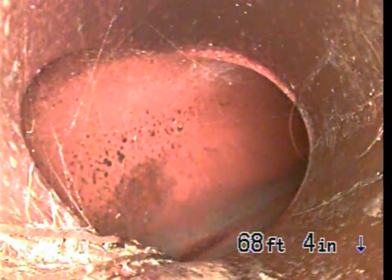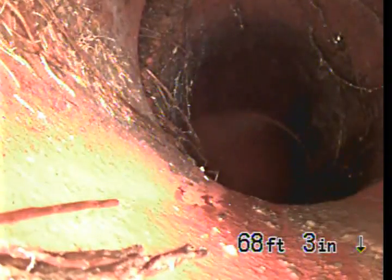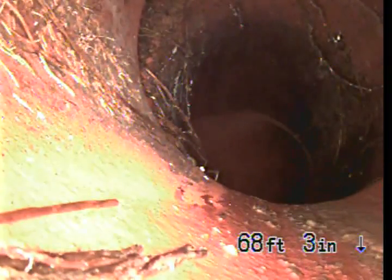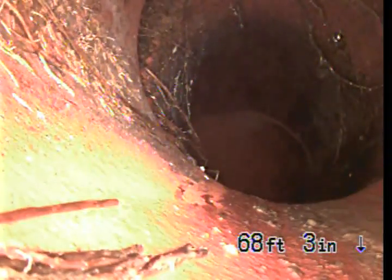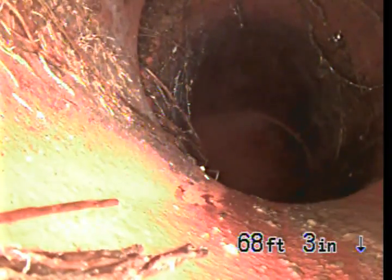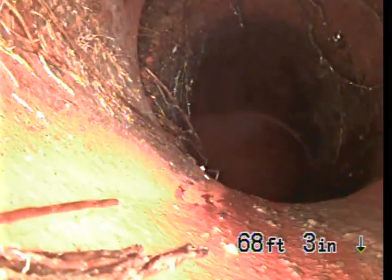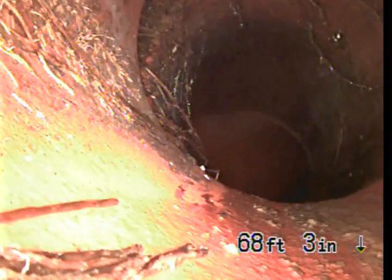City, yours. And then what I'm seeing here is, I guess, the largest defect in the entire system is just this shift where the pipe isn't perfectly aligned at the city. See that? That was probably present at the installation of the pipe, because what happens is you have this pipe coming off the city, it's like a stub end, and you have to make your pipe coming from the house fit it. And what's happening is you're trying to match the slope as you come down, and the city is not matching the same slope as you come to it. You would have to be here to match that slope. So they just make them match as best as they can there. And they put a bunch of sealant around the outside to try and compensate for that.